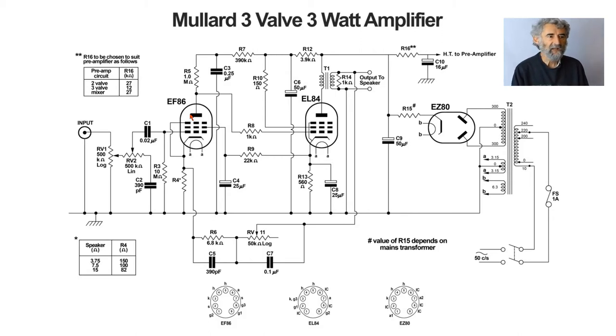There are also two versions of this amplifier in another sense: it was produced both as a power amplifier and as a complete amplifier. In the complete amplifier version shown here, we have a bass control in the feedback network, and treble and volume controls. In the power amplifier-only version, all of these were omitted and the signal went straight into the input valve.